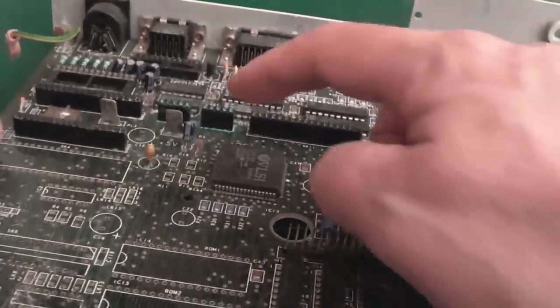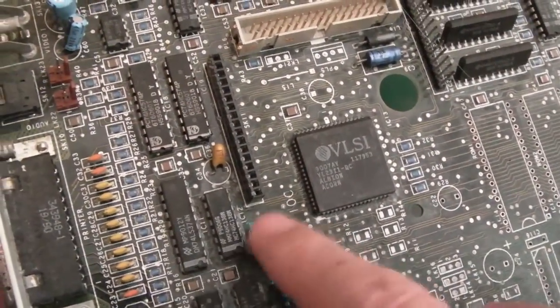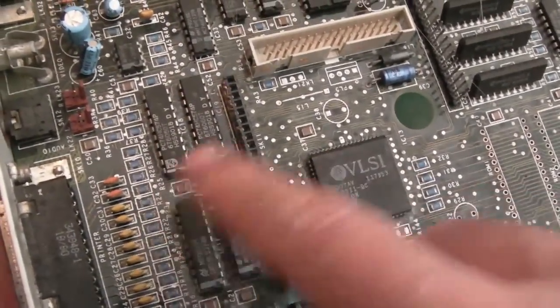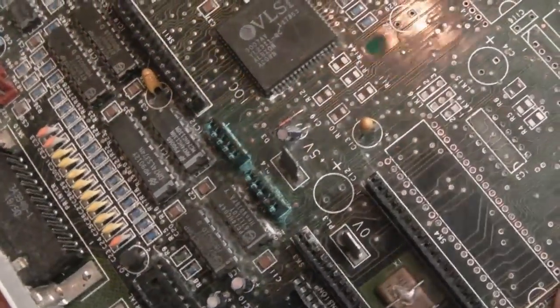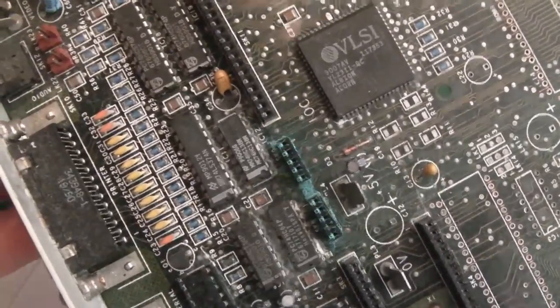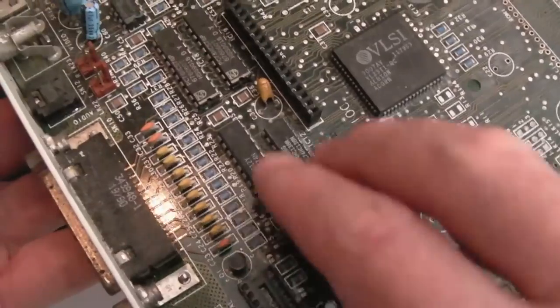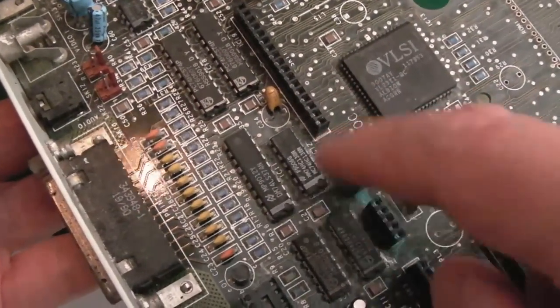The interesting thing is up here, this was cleaned pretty thoroughly, as was all of this area of the board here. But look how these have gone blue. So these are definitely going to need replacing. Some more damage occurred around there, despite the fact that it has been really thoroughly cleaned a number of times. And obviously one or two of the sockets here, and I've got these, and we can remove some of these chips and clean up around there, replace those connectors.